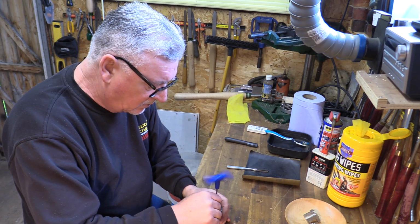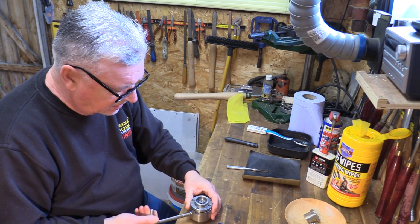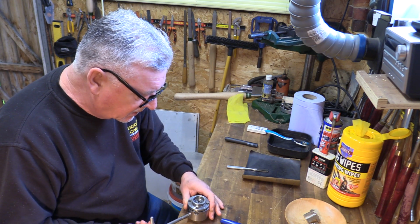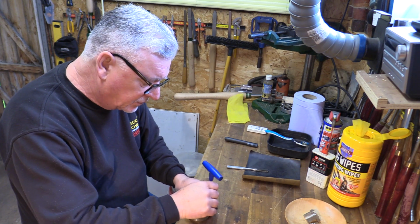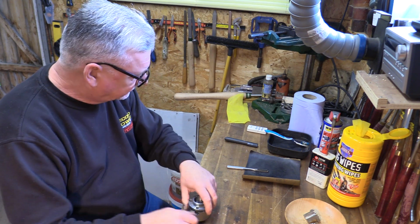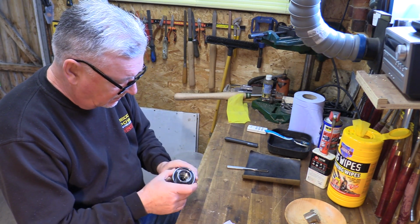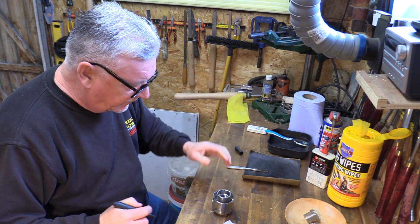Because one thing with small chucks, and this is a really nice small little chuck, is that all your parts are small. So what I'll do there is just bring the jaws in to do the kiss test, pinch some screws up, go to the underside of the chuck now, get some of this dust off it, and mark off one of the faces.